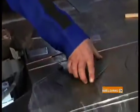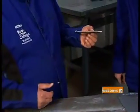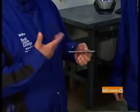Now we know all about the torch — how do we set the machine? What's the proper amperage? You need to set your amperage according to the thickness of material you're welding. For instance, we have some 10 or 11 gauge metal here, approximately an eighth inch thick, which is 125 thousandths. We would need approximately 120 to 125 amps to weld it. That gets you in the ballpark, and from there you can fine-tune it. That's a good rule of thumb for most metals.